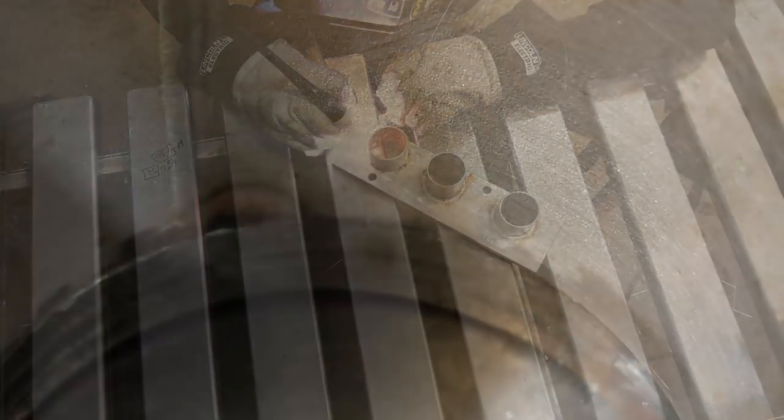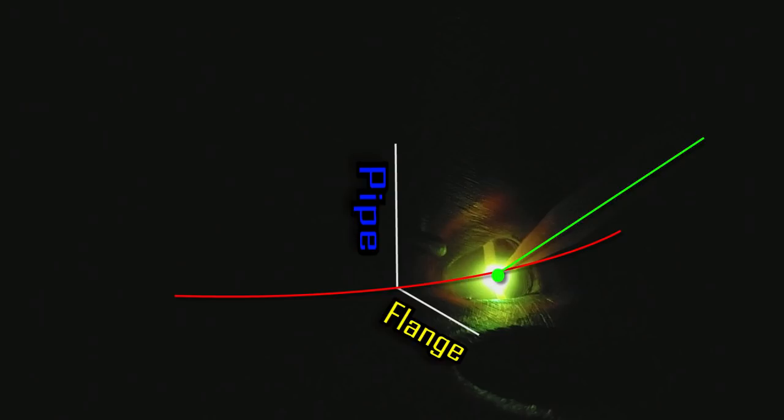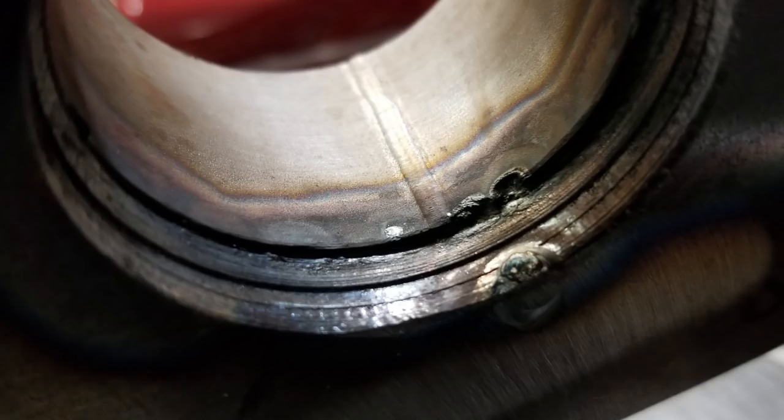Now let's move on to our piece of stainless pipe. This was done the same way as before — butt welded at the top, inside diameter of the pipe matching the diameter of the hole. We work our way around it just the same, with one exception: the focus. If I bisect the arc just as before, you notice the focus is a little more central — still slightly under the halfway point, but more central, meaning a little more heat. Penetration was slightly less on this one due to the thickness, but the exact same amperage the entire way through. This will definitely hold if properly purged — which again, it was not.